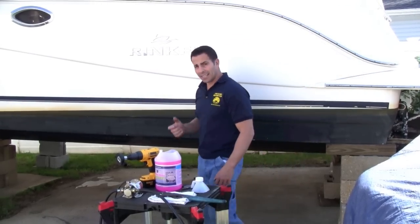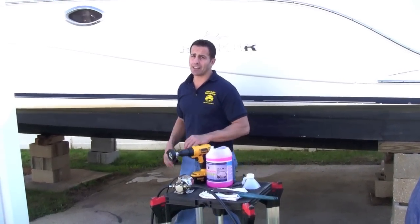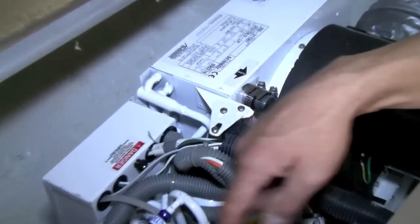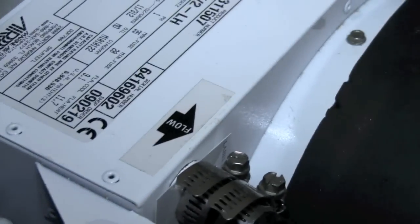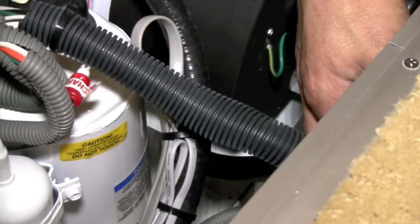Come on with me and let's find the inlet to see where the water is coming out for the air conditioning, and let's find the outlet to find out where we're going to be putting it. I'm in the front of my boat over by my air conditioning unit. If you look at my air conditioning right over here, you can see where it says the flow — this is where it goes out into the front of the boat and this is where it comes in. I'm going to run it in reverse through the whole cooling system, because the way the air conditioning works is it takes the salt water to cool the air conditioning instead of air cooling it. It has to go out somewhere — which is in the front of the boat, the bow — and it comes in from the bottom of the boat.